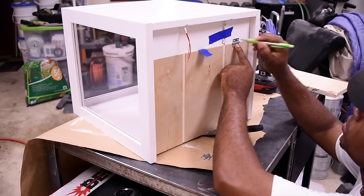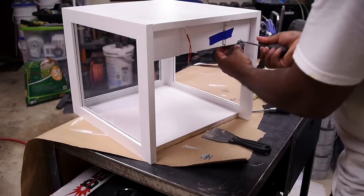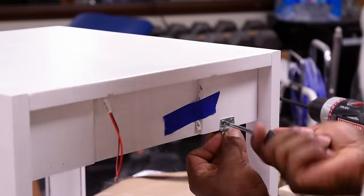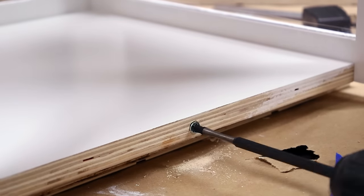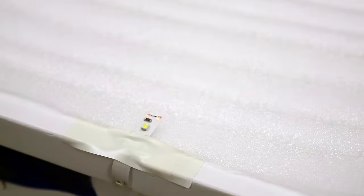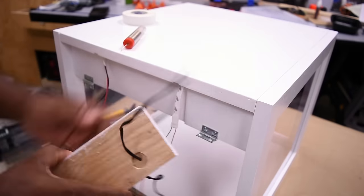I had a couple of options for the access panel. Because the top has the LEDs in it, I set the panel at the back, and since the door has to swing out we need to make sure the hinge is installed to swing out as well. At the bottom center I installed a screw to hold the door closed using a magnet. One side of the LED strip has a lead hanging on it, but because I cut it the other side doesn't, so I started adding leads using 22-gauge wire and taped the connection to protect the splice point.